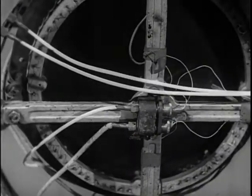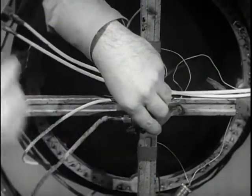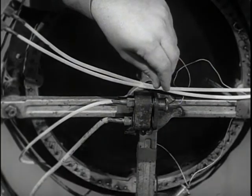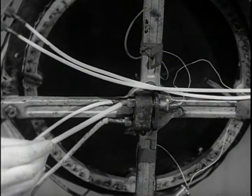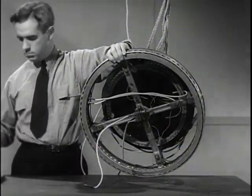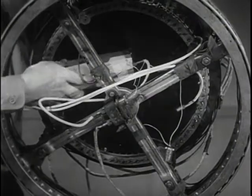The payload is passing through a T-hook and suspended from two blowout plugs in the bottom center of the ballasting ring. When either plug blows, the T-hook is released and the payload falls away. The blowing of the payload plug in the number nine circuit also ignites the fuse leading to the demolition block. On some balloon units recovered, the demolition block has been found not beside the battery on top of the aneroid box, but within the ballasting ring — the logical place for it to do the most destruction to the unit. This region is also a good location in which to look for booby traps.